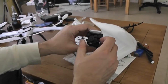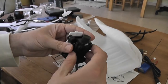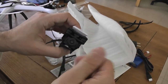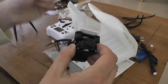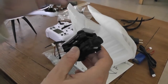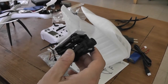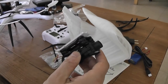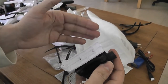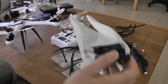I have to make some further investigation and some mods. Out of the box, you will need to mod this camera to reduce the jello effect and to increase the field of view. I will check by disassembling the camera which kind of lens mount it's associated with. I hope it's a so-called M7 mount, so you will be able to screw a new wide lens. When you install a new wide lens, there's another positive effect: the camera processor adapts lights in real time by estimating light conditions. With a narrow field of view, this estimation is done very frequently, so you see a lot of light changes in your video. With a wider lens, the estimation will be smoother over time and you'll have fewer annoying light transitions.